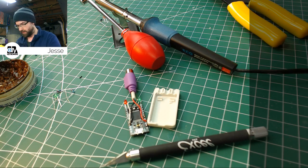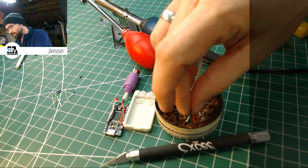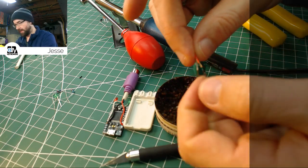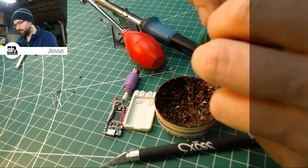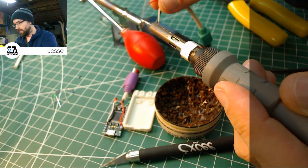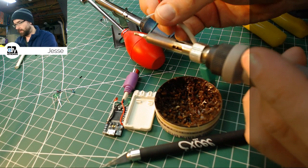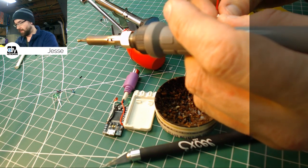And what I'm going to do is bring the paste flux over again, and we'll just go ahead and dip all of them in there, get the excess off, and one at a time we will take these and just wind the ends a little bit like that, make a nice solid end, and then we'll take our iron and just tin that tip. Same thing with the next one. There should be enough solder on the end of this for a few. Maybe even all of them.